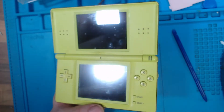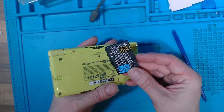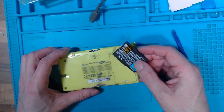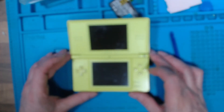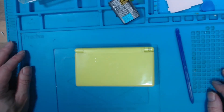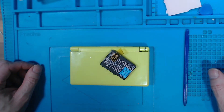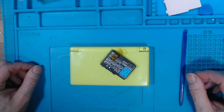So what have we learned from the video? Not a lot - I've got a hopeless webcam. But always start your fault finding, if you can, with some known working parts - a known working battery, a known working charger, that type of thing - and things will go much easier. Thanks for watching - that's what you get for eight pound off eBay. The next one will hopefully be properly broken. If anybody knows a way of cleaning the inside of there, let me know in the comment section below, and like and subscribe and I will see you in the next one.